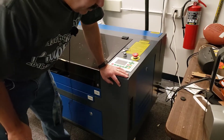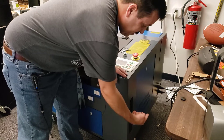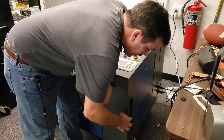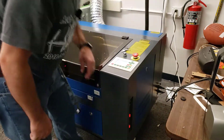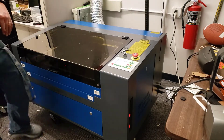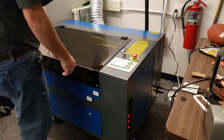Let's get ready to fire it up. First I'm making sure everything is in the off position. I'm going to disable the emergency stop with a left turn, then turn on the water pump power, and then turn on the main power. We've got the controller firing up and we've got water going through. With that moving, let's turn on the actual laser.